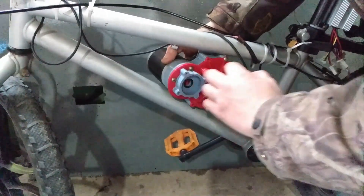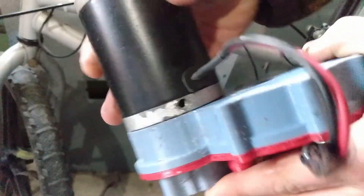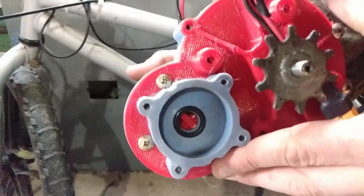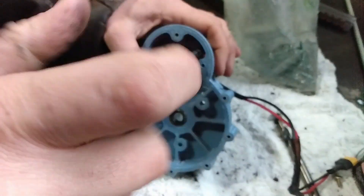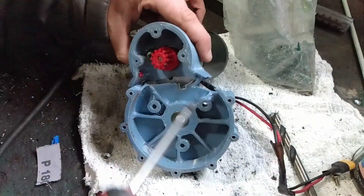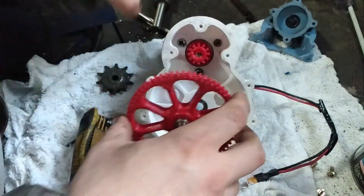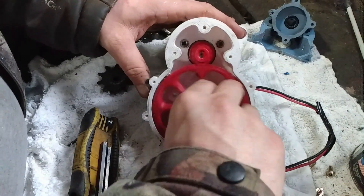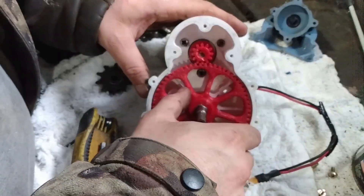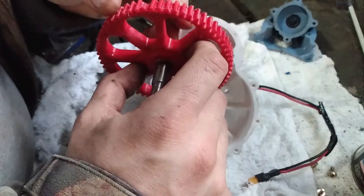During my previous experimenting, I was trying to stick an air pump on the side to run cold air through the motor, since the motor I'm using is pretty much sealed up and doesn't allow for airflow. This didn't really work well, so I'll be getting rid of it. Getting the motor out, you can see one screw was the only thing really holding the back panel together. Taking the bearings out of the old gearbox, the only thing I noticed is one tooth missing, and the drive lug for the air pump broke off — I'm assuming a little piece of it went through the gears. It's only about half a tooth though, and there are about three teeth in contact at all times, so it should be alright.